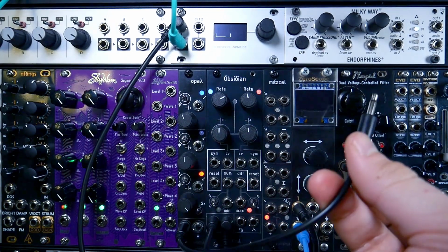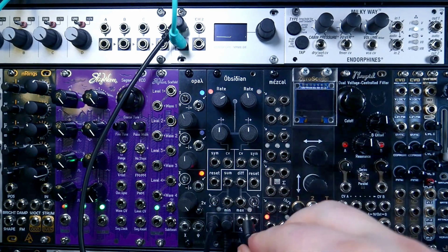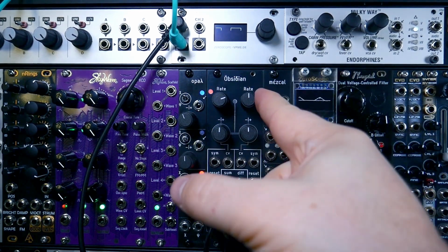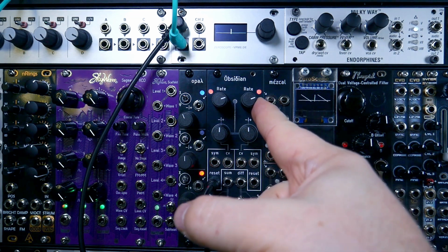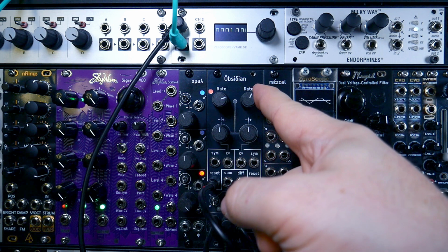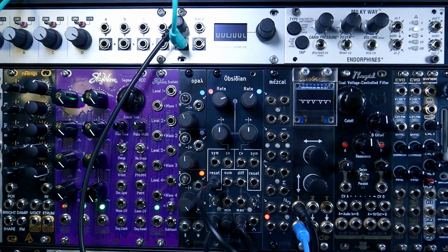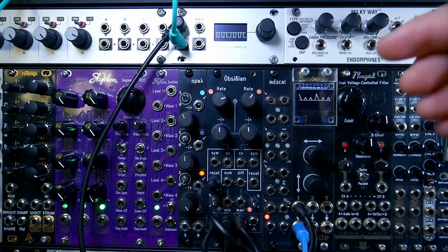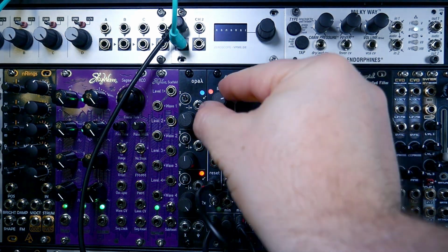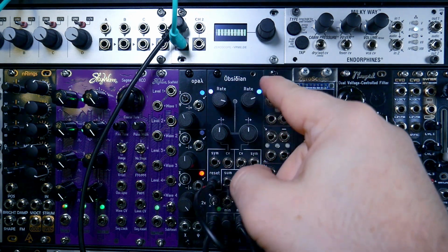And of course, we have the reset input, which resets our waveform. I'm going to set the second LFO to be our reset with the pulse wave and set that into the reset of input 1. You can see it's doing really interesting things to our pulse pattern with the reset. And similarly, it's adding a spike every time we get a reset of a higher voltage than the waveform itself, similar to the symmetry, which was also giving us an additional spike in voltage up to clipping level. And you could have nice fun with hard sync, basically, is what this is.